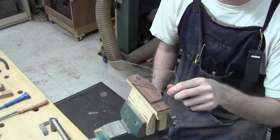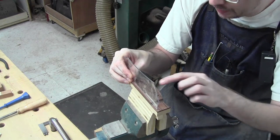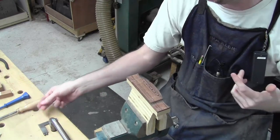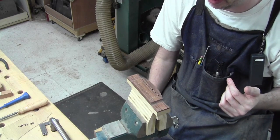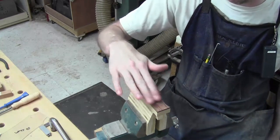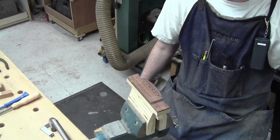For the radius of this, I don't have any radius gauges but I have my headstock shape template and this curve makes a drop of about a sixteenth of an inch, maybe slightly more. I'm going to use that as my guide to bring the top down to that radius. We'll see if it works out to the desired result, but it'll give it a little radius and I can pillow things a little more. Back to the music — I've got more sanding to do, I'll sand one side then the other.